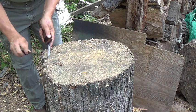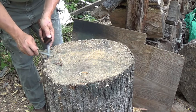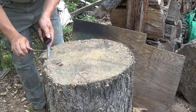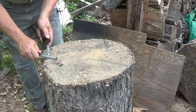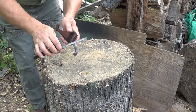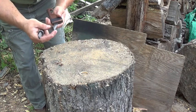If you wanted to, like on a Scandi blade, you can put a secondary micro bevel with a ceramic rod. I do that on mine, on my crook knife. It just seems to last longer. All you do is take a ceramic rod at a steeper angle and just with the weight of the rod, just hit it, and it puts a micro secondary bevel on it.